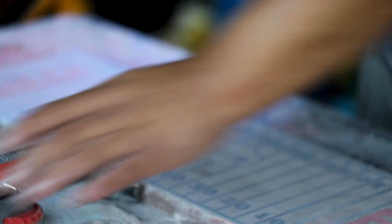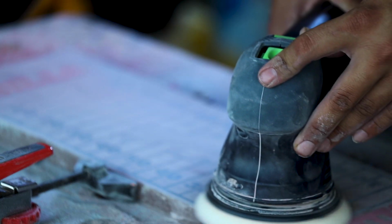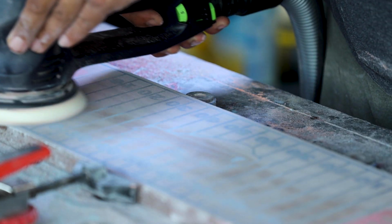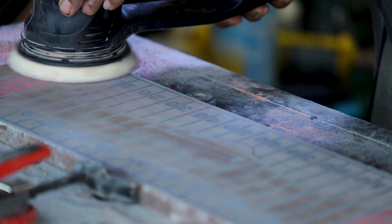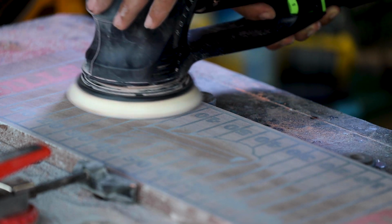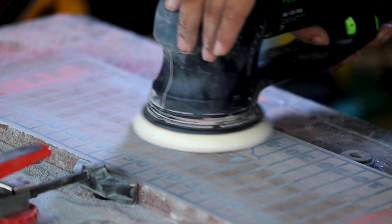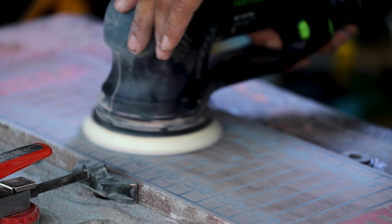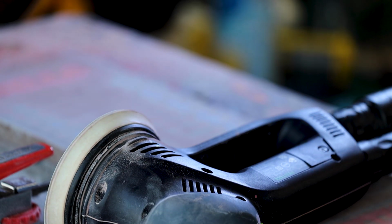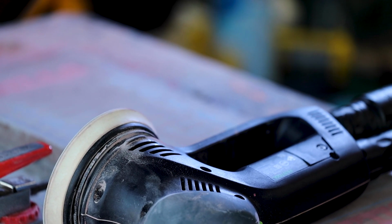So you'll move up through the sandpaper, going from 120 to 150 to 180, 220, and 320. Making sure you wipe down the surface every time, every sandpaper. Make sure it's clean and it's a new surface. A vacuum is highly recommended in this step because, again, with that cross contamination, you're not rubbing the dust on there. It gets really technical, but it does make a difference. The more of this you apply on your workpiece, the better it'll come out.